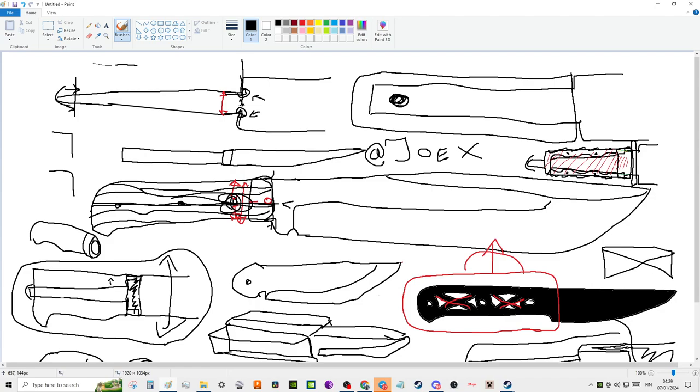Let's go back here. So when we have a guard and a ring and a through tang handle, now it's peened forwards, when those forces are coming up, they're pushing into here, right? So you don't get fully lateral movement, like if you see here, it's kind of pulling from here. And what this block with the guard does is prevent the blade from trying to pull itself away from the bottom of the handle, because you've got this nice hard flat surface that the tang is peened and the whole handle is pushed up against.